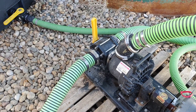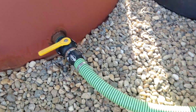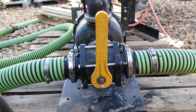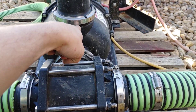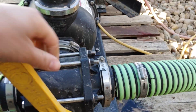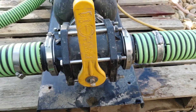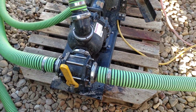I set the station up so it's hard to make mistakes. Water comes out of the red tank through yonder three-inch hose and comes to a three-way valve on the inlet side of the pump. This valve allows fluids in from either side and then goes out the middle. If I take this handle and go over that side, water comes in and goes into the pump. But if I take the handle and go over this way, fertilizer can come in and go into the pump — but it cannot go to the water. So it prevents mixing when I don't want them mixed. Fertilizer one side, water the other side — kind of hard to screw that up.